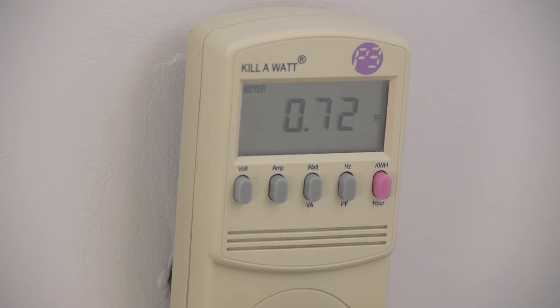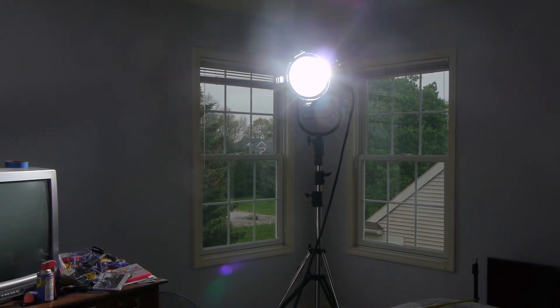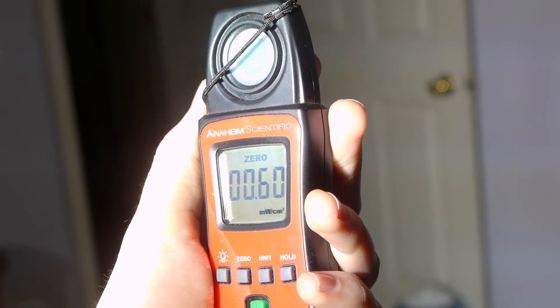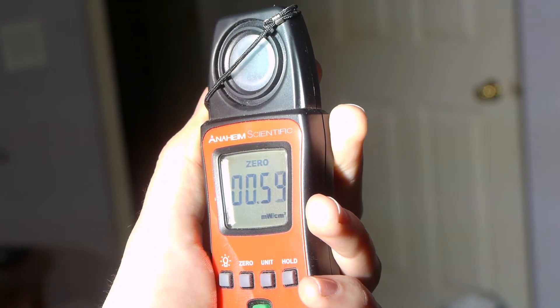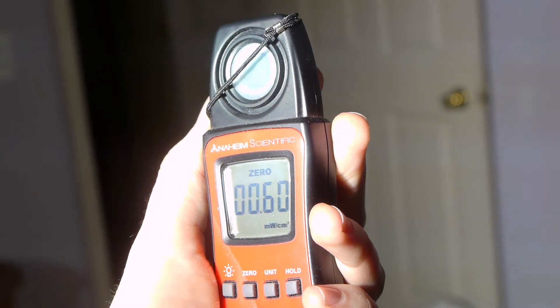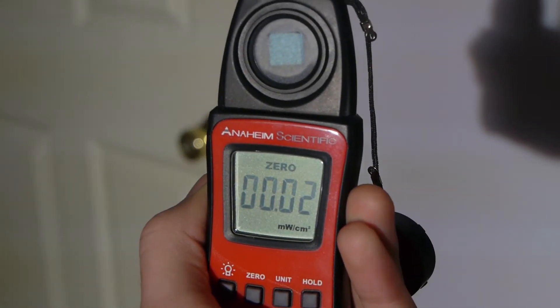Keep that in mind — if you're running household power or any gig where you have 20 amps, or you're willing to trip a breaker to fire it up, you should be okay. But it's a big question mark. Moving on, there are two other things we need to talk about before showing test footage, and the first one is the UV meter readings. I bought this UV meter off Amazon for cheap — like 100 to 200 bucks or something. It's not perfect, but it gets the job done. At five feet on flood mode, we're getting about a max of 0.6 to 0.7 milliwatts per centimeter squared.